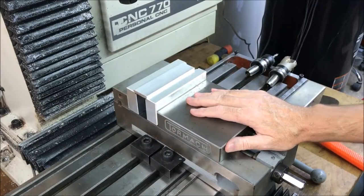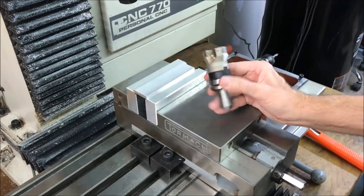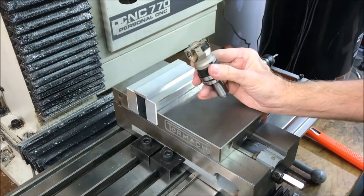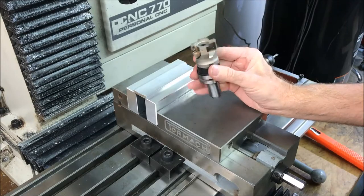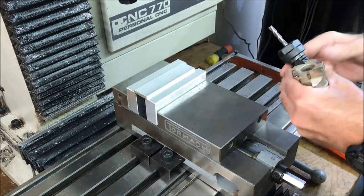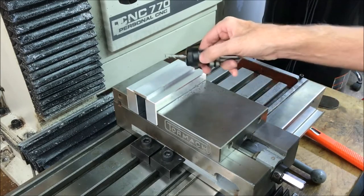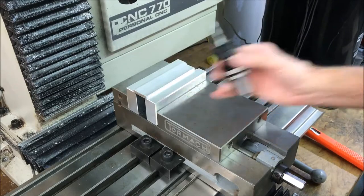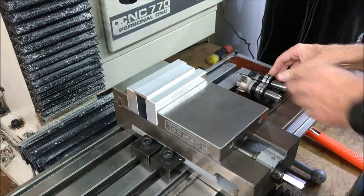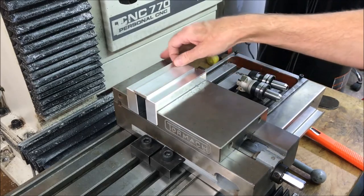Okay, I'm going to kick it up a notch now in the 5000 RPM spindle range. I'm going to do the face milling with the 38 millimeter face mill from Tormach. And again, I'm going to use the quarter inch 3-flute end mill for the adaptive clearing and for the finish. I'm not going to get too aggressive because I'm still only grabbing it by 50 thousandths in the soft jaw.